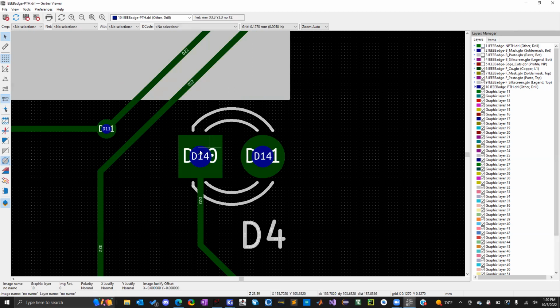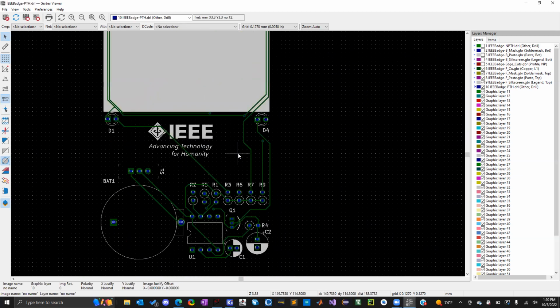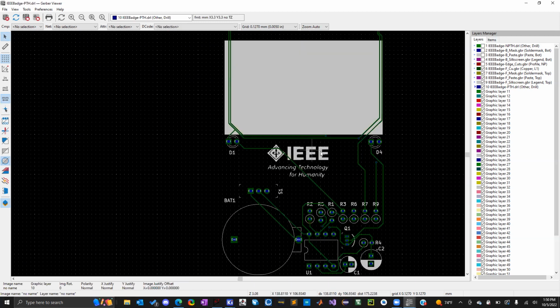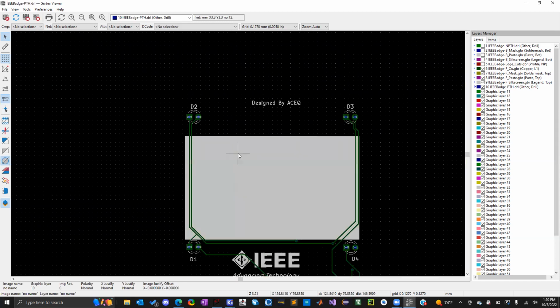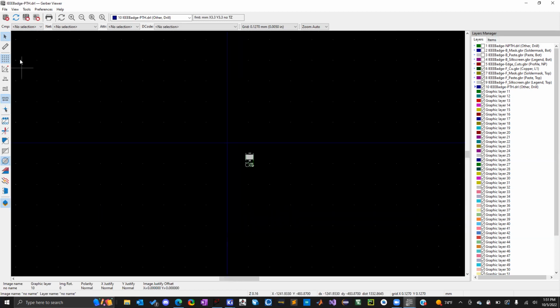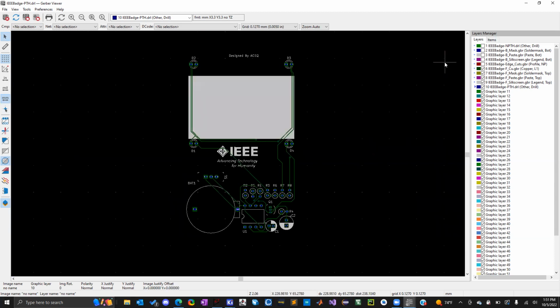Okay. So you can see that they're going to drill holes for all the components here. And for the vias too, because they have to drill the holes for that too. And you can see all the components and all the holes line up properly. Sometimes it may turn out that the drill holes are somewhere else, like out in the abyss of the file. So keep an eye out for that. Sometimes that happens. Just to verify, are you guys' drill holes also lining up?